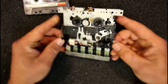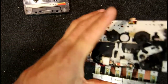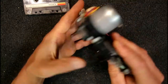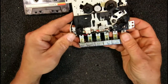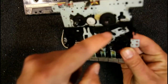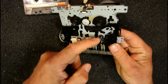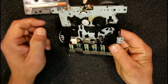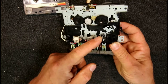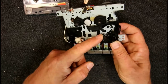When we get to the take-up reel, it's actually driven. In this particular mechanism the motor runs the capstan. There's also a reel drive for fast-forward and rewind via a little idler, but that's not related to the playback reel drive. There's actually a small gear on the front of the capstan shaft that drives through to a larger gear — I think there's another gear on the back first — which drives this gear that has the auto-stop mechanism.